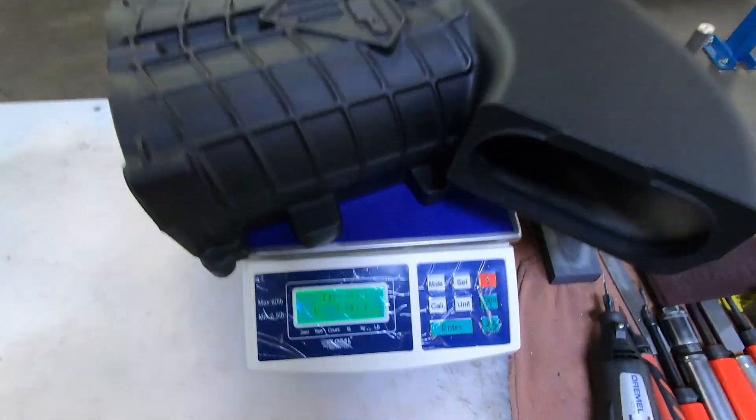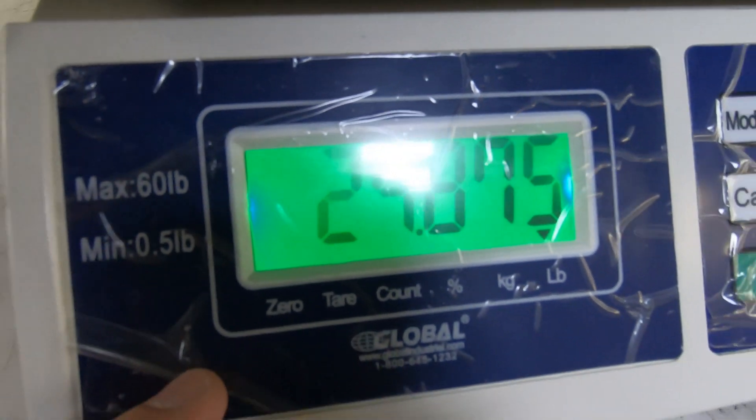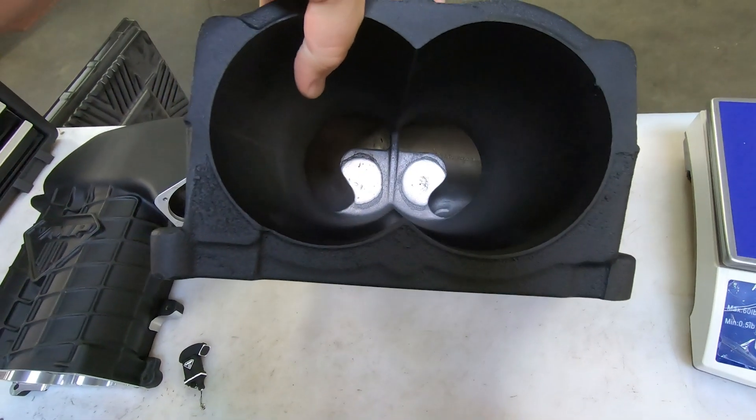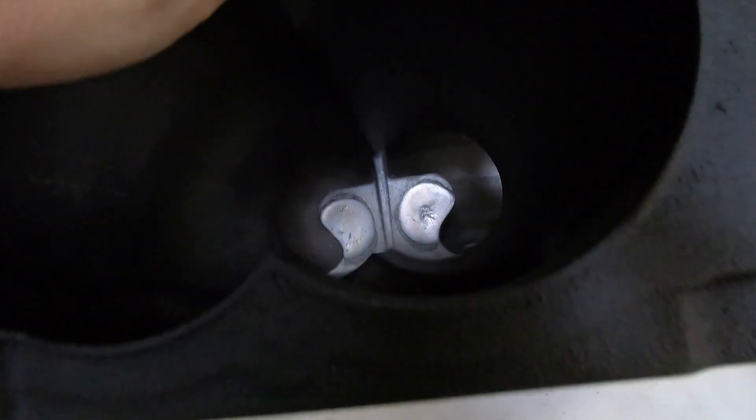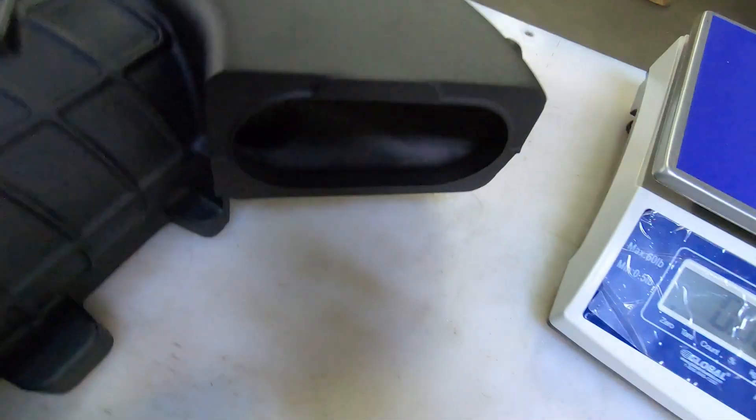The Gen3R starts out at almost 25 pounds. As you can see, the rotor bores are already cast into the supercharger. It's got the basic shape of the discharge of the Magnuson Stage 2 DFT inlet. From there, what has to be machined is all the critical parts — the mounting flanges, where the bearings for the rotors sit. The actual rotor bores themselves are incredibly critical, so those rotors can spin freely anywhere from a couple thousand RPM to 25,000 plus RPM. These are all critical machining tolerances, and we'll show you what goes into making these superchargers to maintain those tolerances.